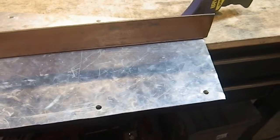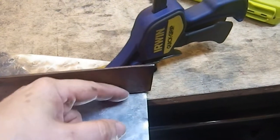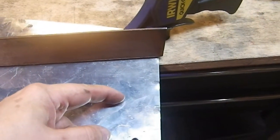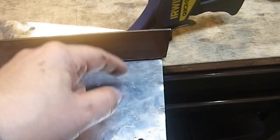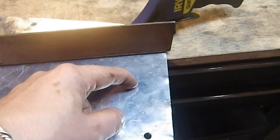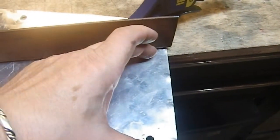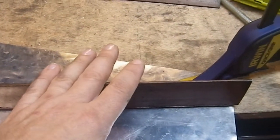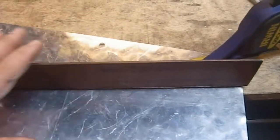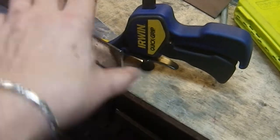It's taking me a little bit of finagling to pull this off, but the distance between here and the blade of my new track saw is 2.444 inches. It's a weird measurement, I know. And if I want to have 2 inches taken off, that means that this distance has to be 4.444 inches. And it is from here to here and here to here. And this is actually one of the rails that's going to be part of this project, so I'm just using that as the guide. And I've got my clamp set up in this hole because that keeps it out of the way.